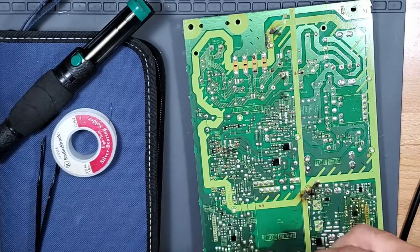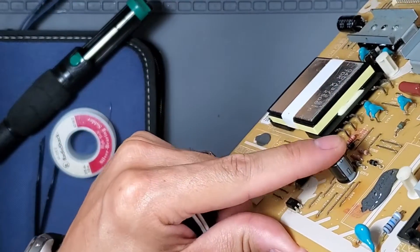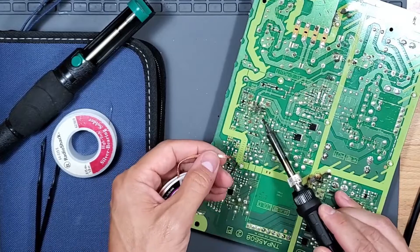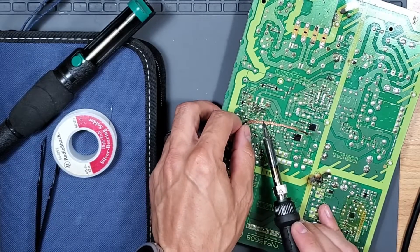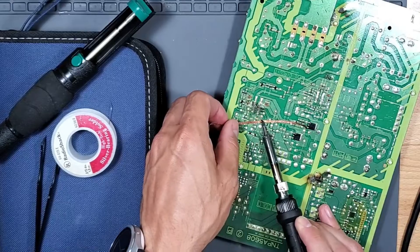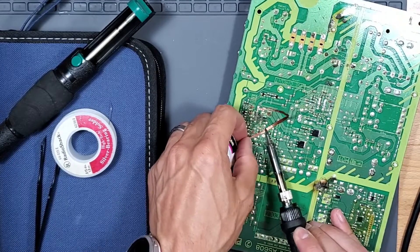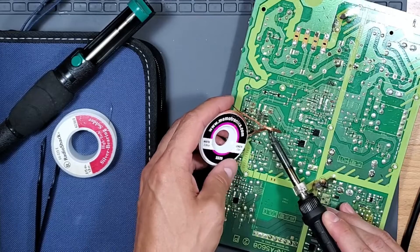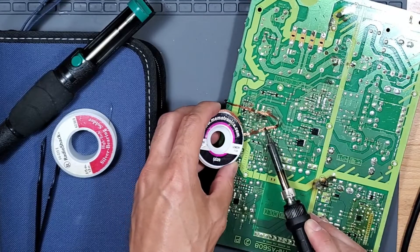The next method is not really my favorite but it works. Here's another capacitor — I'm showing capacitors because they're the most common to go bad in a power supply. So here's the capacitor on this side. This way is safer on the traces; if you pull out the capacitor and it's not properly heated, you can rip off the traces or the solder pads, which is not good. This right here is called a desoldering wire — it's basically a copper braid with flux in it, a chemical agent that absorbs the solder into the braid.